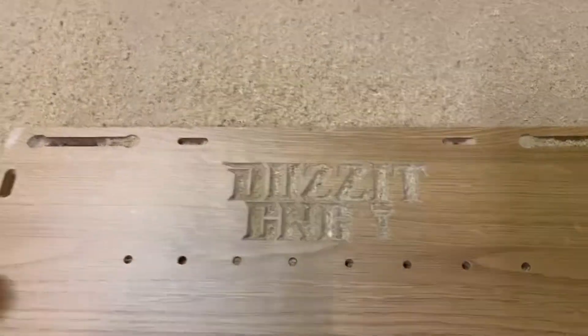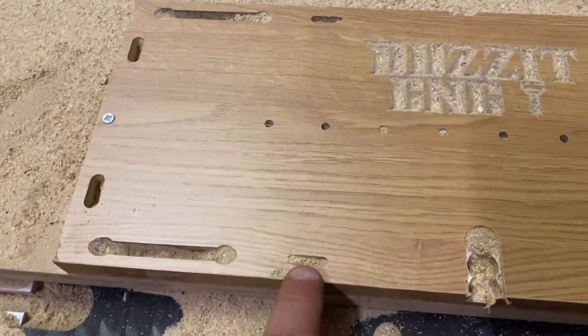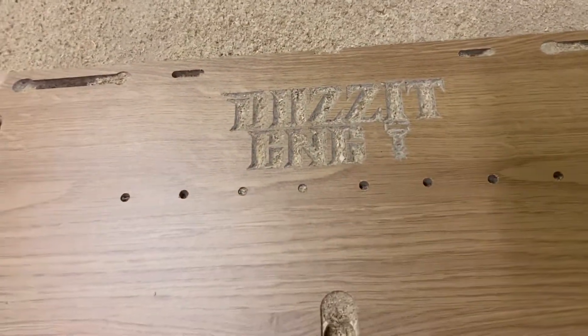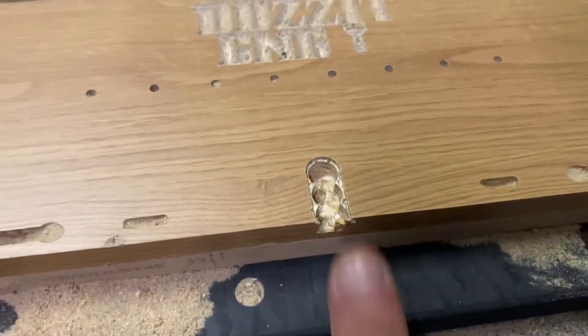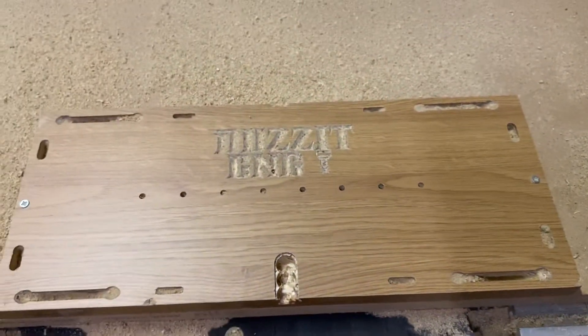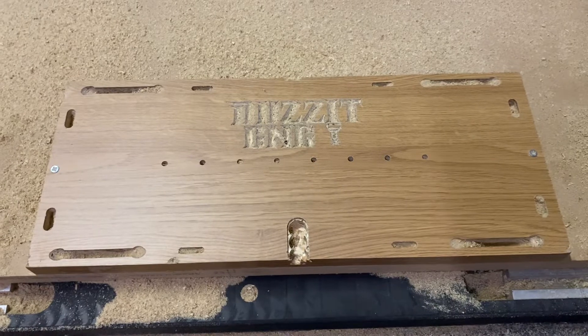So I did a V-carve which does a CNC. I came in and did the 5mm domino holes. Obviously they're still dirty at the moment because I haven't got the dust extraction on. Then we did the special P-fittings. Then some shelf pin holes, 5mm shelf pin holes. Then the special fitting for the Cabaneo — you can see the Cabaneo just pops into that cut-out. And then the 8mm dominoes, all done with a 5mm cutter. So you can see how quick it is. There are way more fittings in that board, but all the jobs are done in one go with two different cutters and the tool changer.